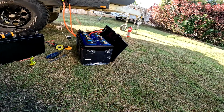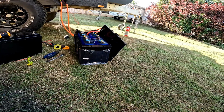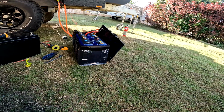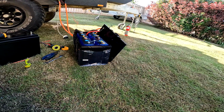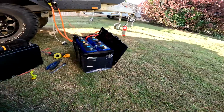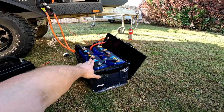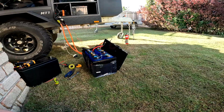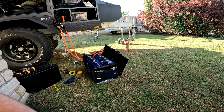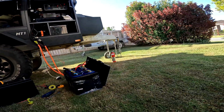which is exciting. I never expected that, and they've been pulling the solid 180, 190 amps, no worries, running that heater flat stick the whole time. It's very impressive for completely pregnant cells, and as I was saying before, they're only warm, they're just a little bit more above room temperature. It's the BMS that's gotten quite hot, but it's averaged out at about 65 degrees now, so yeah. Let's see what we get to, hey?